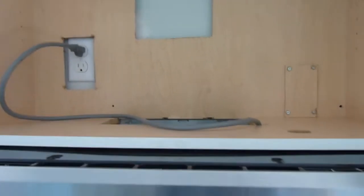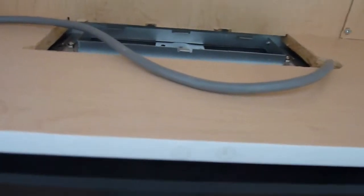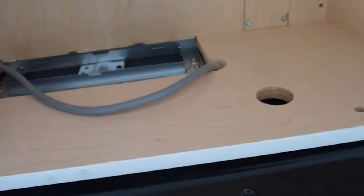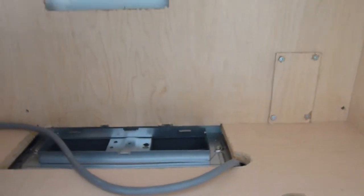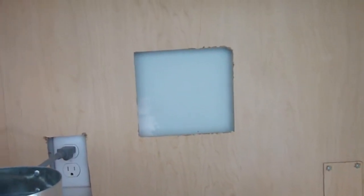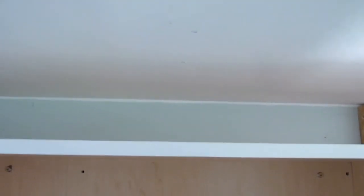The first problem is that the vent up top is too close to the back of the cupboard, so it does not actually drop into place. I'm going to have to cut some of this panel out. This is a used cabinet, and that pre-existing hole is probably a little too low. The other problem is that five inches does not fit up there — four inches does. I might have to change the ducting or cut out some of the ceiling.